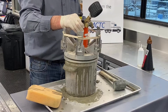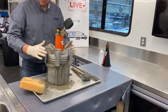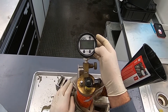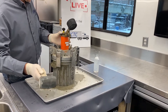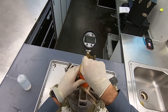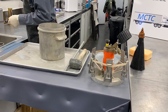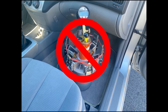You may have noticed how we keep the clamps up by using a large rubber band. This makes running the air test easier as well as storing the device. When you clamp down the lid, do so on opposing sides simultaneously. Every time you press a button on the device's gauge, you need to support the back of it as if you were squeezing it — this is to prevent the gauge from breaking off due to repeated stress. Avoid the clamps when you strike the device with a mallet, as hitting them will result in an invalid test as well as potentially damaging the clamp. When pressurizing the device, getting it within plus or minus 0.01 to 0.03 PSI is preferred over 0.05 PSI. Wherever you plan on using the device, let it acclimate to the ambient temperature. For instance, if you plan on using it outside on a warm day, don't let it sit in an air-conditioned vehicle before use.